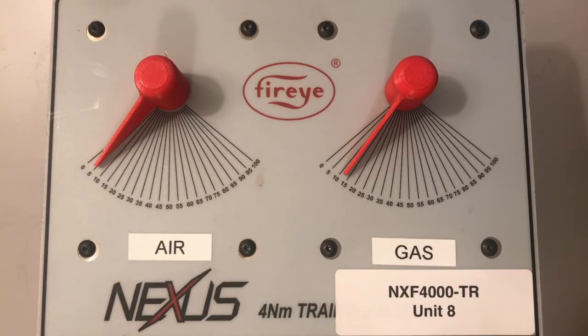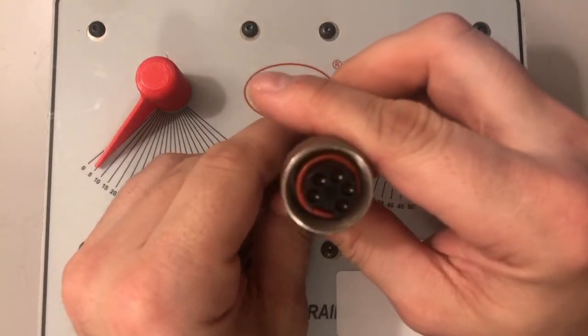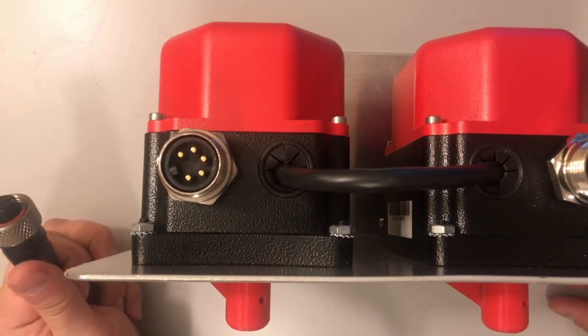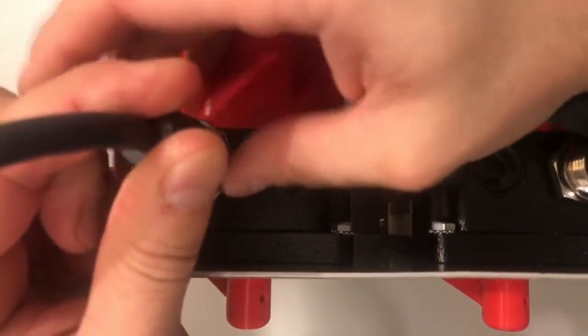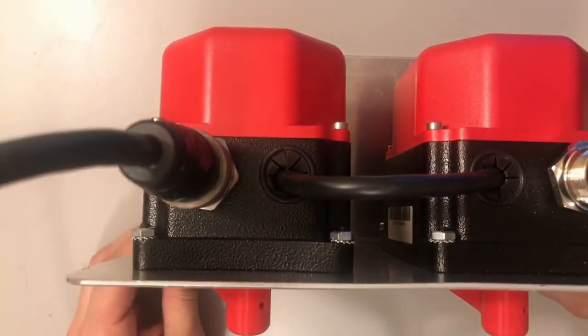We also have another option, which is a dash-one at the end of the part number for a quick disconnect fitting. If you use the quick disconnect fitting, it allows you to use pre-made cables to connect the servos together in your installation. This is a quick connect cable right here — it's got five pins pre-molded and ready to use. This is actually a hybrid that has one quick disconnect fitting and then a wire going between the two servos, just for this particular trainer case. To use the quick disconnect fitting, we simply slide it over and screw it down. These come in a couple of different pre-made sizes, or you can also get the wire and fittings and make your own. It's a great way to make it easy to connect and disconnect the servos.